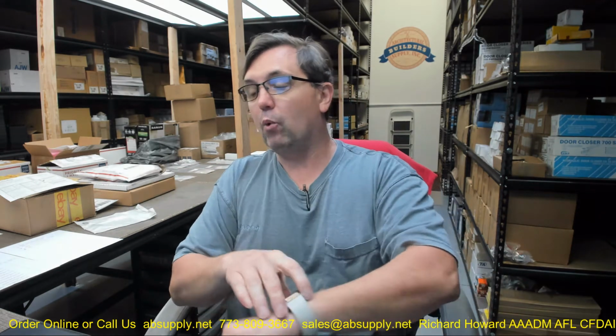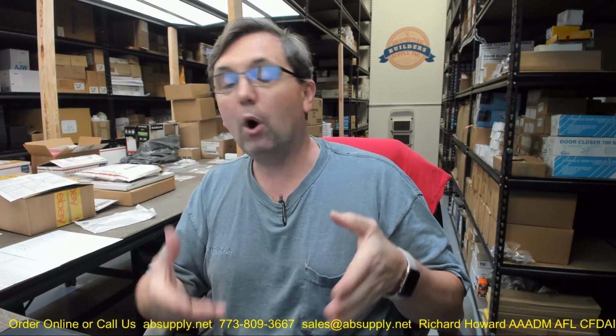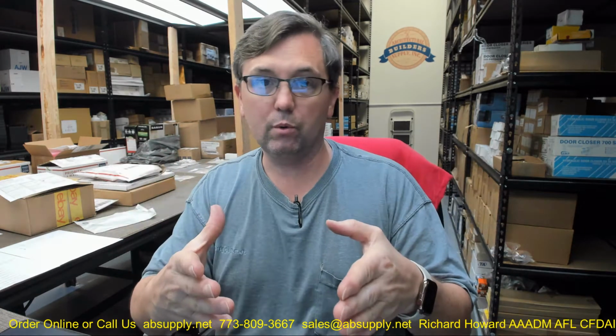They're all related, and what makes them important to each other is that you could order a C230 key blank. You wouldn't get a plug, a cylinder with a C230. It's available as a key only, and pass that key through any of those 3 keyways. So the lower level you're going to get as cylinders, and then of course as cut keys. The multi-section key blanks, the row of 3, the row of 2, and then the top one, show via their arrow indicators what they can run through. Okay, so literally the C000 is going to be able to run through all of those, including the simplex key, the C235. Simplex means that it stands alone.